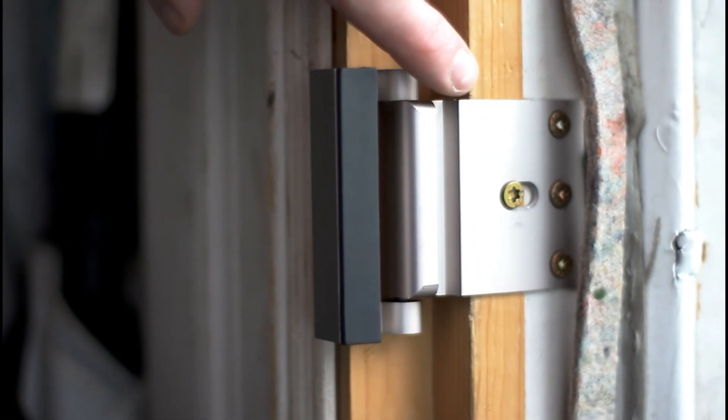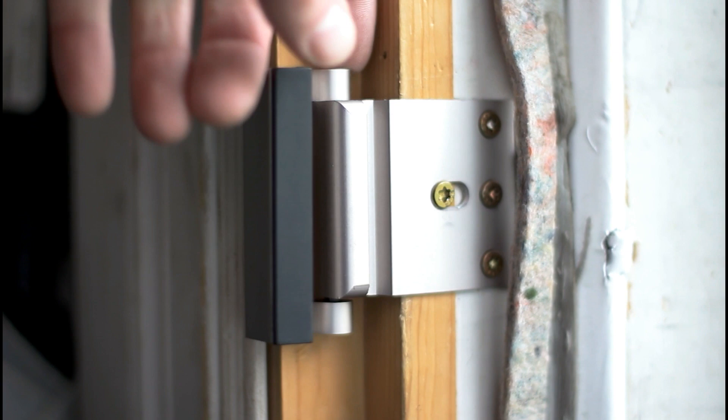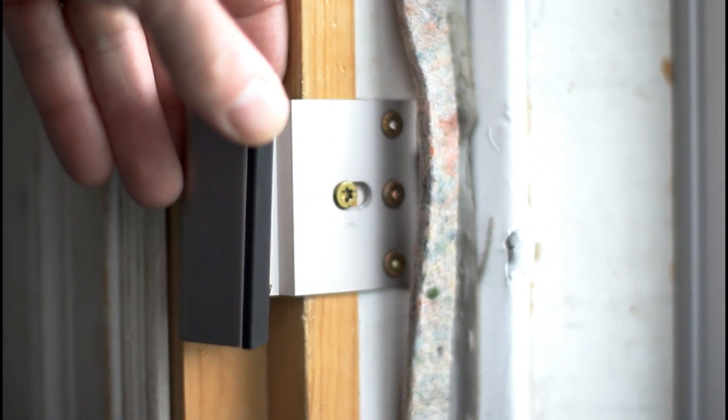For a real quick installation, that worked out pretty well, and for the most normal installation it's going to be just that easy. But for my particular installation, the latch is a little bit too far away from the door, so I'm going to go ahead and notch the door frame out just a little bit to get that latch recessed inside there so that it comes just close enough to make contact with the door when the door is closed. So there's no wiggle room at all.